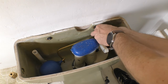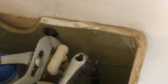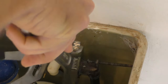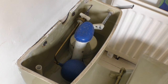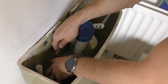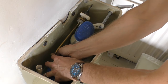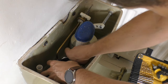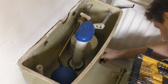It really wasn't very difficult - I can probably do that by hand now. Now it's on with the new one. I'm just going to move that slightly out of the way so I can tighten it up. What I like about this valve is the design is actually really clever and quite versatile in terms of fitting the float. I don't know exactly what height the float needs to be at this point, but I'm going to put it in an approximate position. I'll use my smaller adjustable spanner to do it tight - but not too tight - and now it's on with the water to see how it performs.